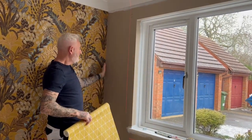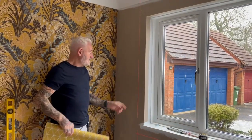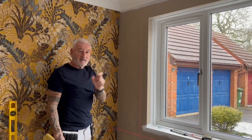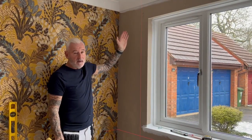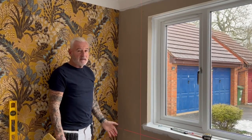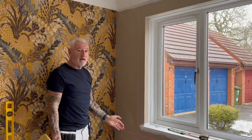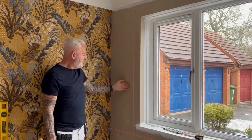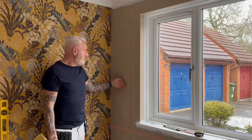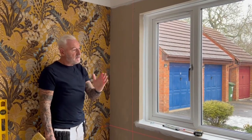In this case my corner here is level so I can come away from there. If you find when you're hanging longer drops, this laser level is invaluable. You can put a spirit level up but the bubble in the gauge isn't perfectly accurate. If you're coming down a hallway and you've got a 12 to 16 foot drop, you might not run straight all the time. You might start twisting your paper and that's when your paper will overlap — you may have it perfectly level at the top, but as you drop down with a big length of paper you might twist it just a millimetre or less, and it'll overlap. It's because as you're brushing out or smoothing your paper, you're twisting it slightly or the paper's stretching.